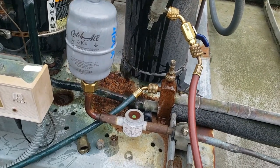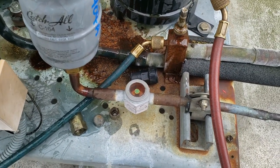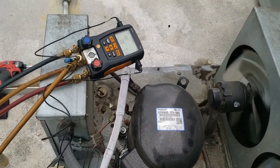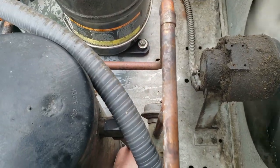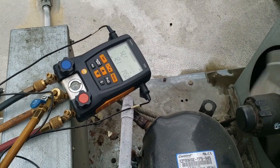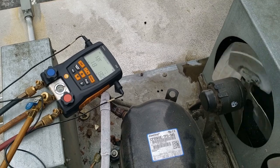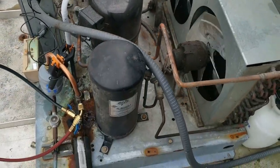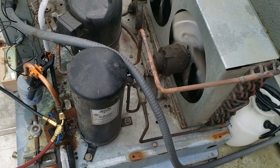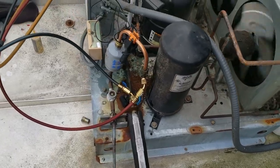I'm confused on this one — unless we got something going on with the TXV, but that still doesn't explain why that was splashing and then was pretty well empty. Hard to fix something if it's not going to act up while I'm here. I cooled down my condenser and it wasn't until I hit about 175 that I finally started feeling hot gas come through the suction, my head pressure started to drop, superheat was really high — and look at that, she just shut off. It really appears we've got something going on with the headmaster control not working properly.